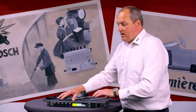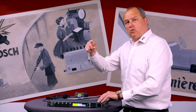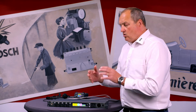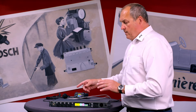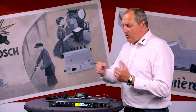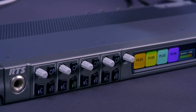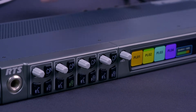This OMS can be connected to seven other OMS units through the same Omnio. The Omnio channel connects OMS one through eight, and it is not discoverable — you don't see it in your Dante controller — so you get this extra channel on top. These are tie lines between the different OMS units, connecting party lines one through four across all units.